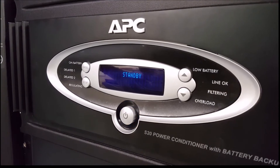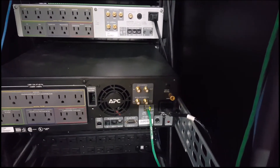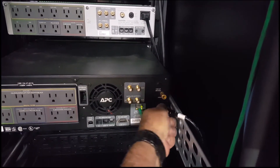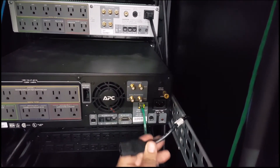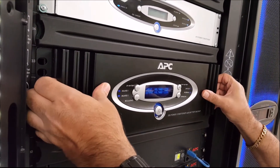After the UPS is powered off, if you wish to perform a cold start after performing the brain dead, you may wish to disconnect your load. The second brain dead step is to disconnect power to the UPS unit, either from the back of the UPS or from the electric outlet.